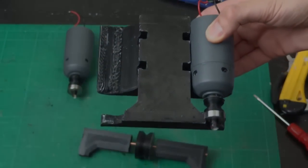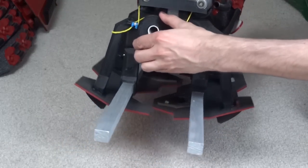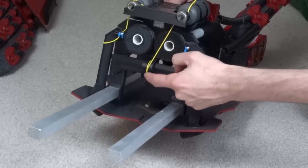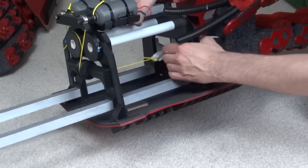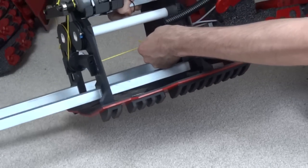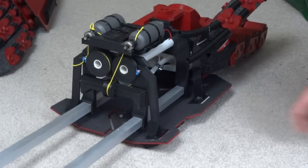Here are my motors mounted on the arm — I've had to put this on the floor because things are getting a little big. I've got one motor here which pulls that pulley to activate the hand plate. The other one goes through this pulley in the middle — it's in the middle for a specific reason — and that one pulls the fingers. I still need to fit a return spring on there. I've got an anchor point built into the silver plate to facilitate pulling the fingers back, which I haven't installed yet. I'm probably going to change that bright yellow string for another colour, but for now it's easy to see against all the black.